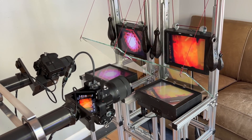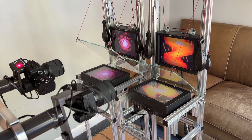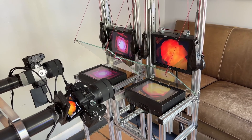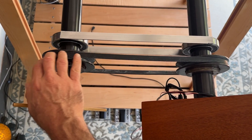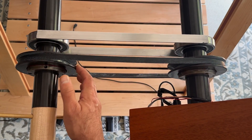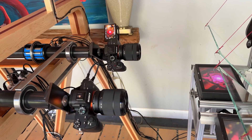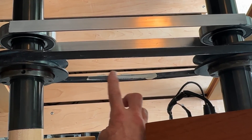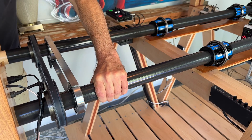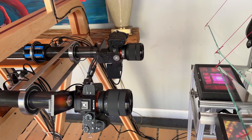It's important to be able to change the relative rotation of the cameras to each other — for instance, to have one camera at 90 degrees while the other one is at 180 degrees. These V-belts are designed not to slip within the grooves of the pulleys — actually, they're called sheaves — and that would make it very hard to change the relative rotation. But by putting a little bit of grease on the belt, it is possible to rotate one shaft while keeping the other one still, so the rotation of one camera can change while the other does not move.